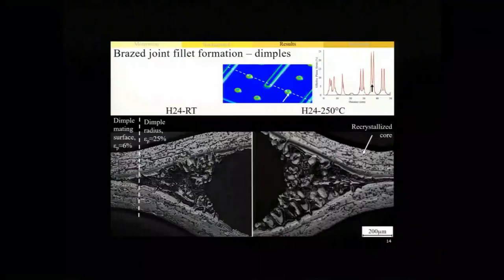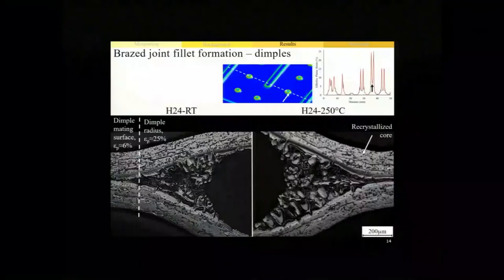The last results shown here were taken from brazed dimples in plates formed from H24 sheet at both room temperature and 250 degrees. Again, within the brazed fillet itself we have the alpha dendrites and eutectic structure as expected. Through the core alloy along the length of the joint, the grain structure is more homogeneous. At all locations we have a slightly coarsened recrystallized grain structure, and that was present for sheets formed at both room temperature and 250 degrees. We didn't see any obvious differences when we increased the forming temperature for these sheets.